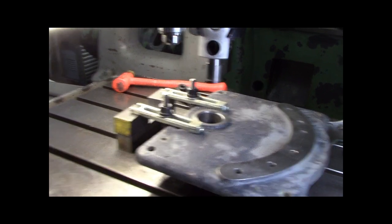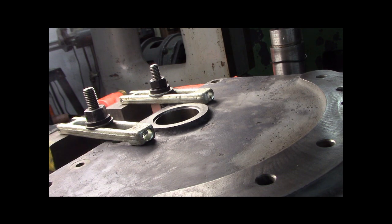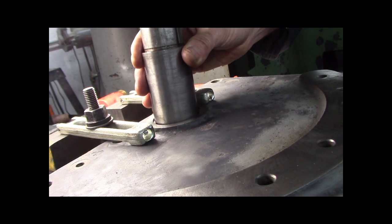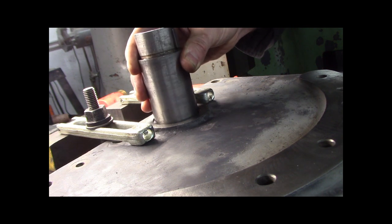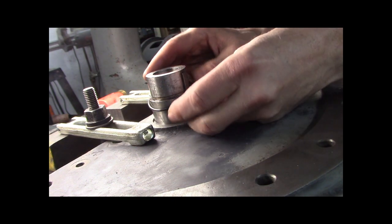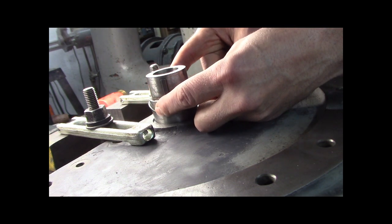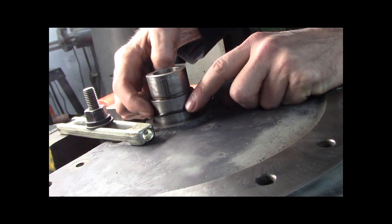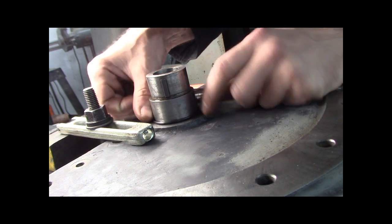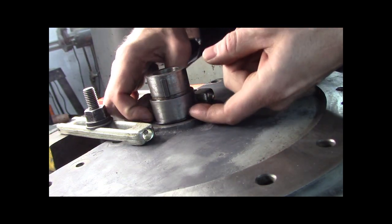So let me clean up and then I'll bring you back. All right, guys. Maybe I can do the fitting in place. So here's that 2-inch shifter shaft. Okay, here's the O-ring, right? Put that on there. Yeah. So this is a 3/32 O-ring. Just happen to have one. They make 16th, 3/32, 1/8 inch, 3/16, quarter inch. I like that. Will the O-ring go in the groove is the question.